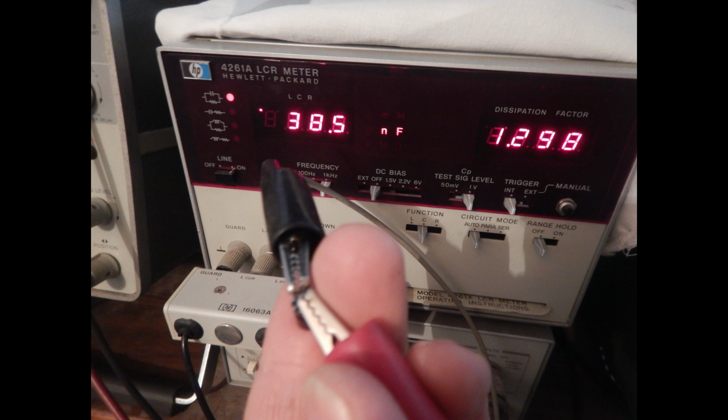I've also substituted two other capacitors with the same brand and value, even if they showed no signs of leakage, but left alone all other capacitors on the board that were testing fine.